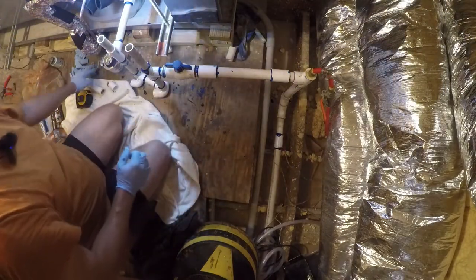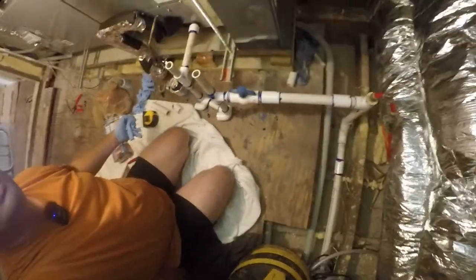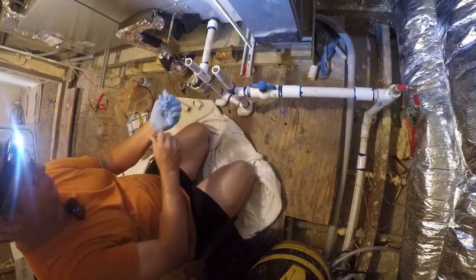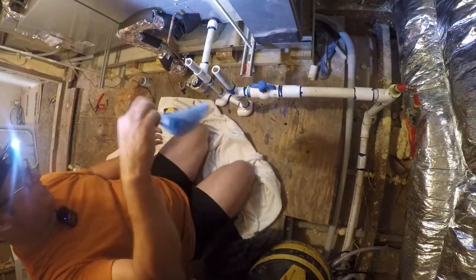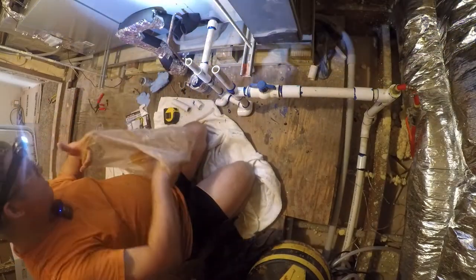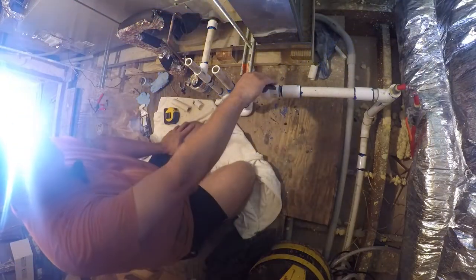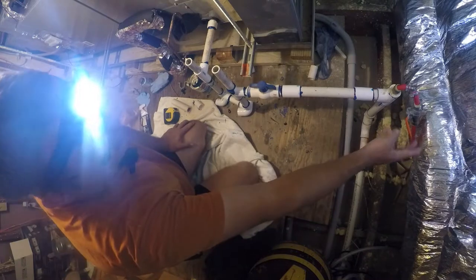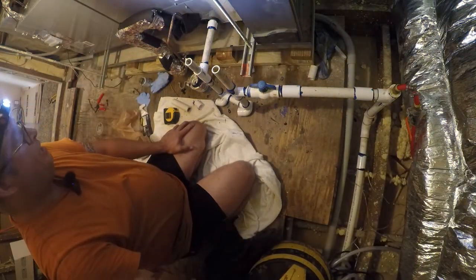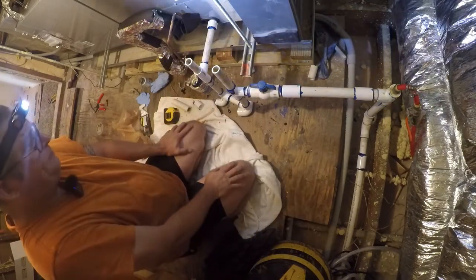The only thing that really needs to happen is, and here's a neat little trick you can pull to wrap up your messy waste, we really need a cap for that. So, and I'm pretty sure I do not have one. That stays open. This allows me to cut this off, turn that on, and that will blow water down there to clear anything out of the line. I can drop bromine tablets in here to keep this trap clean.